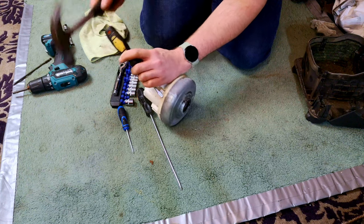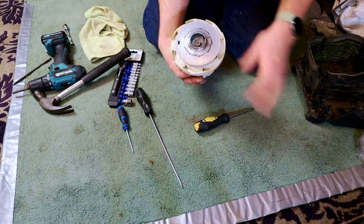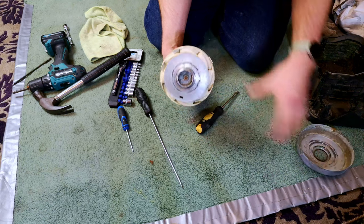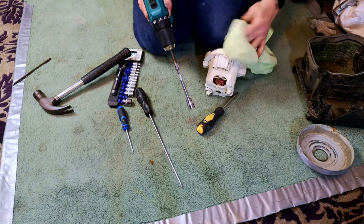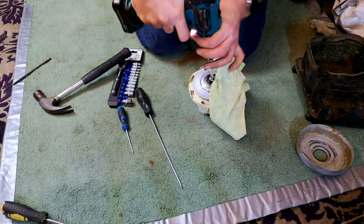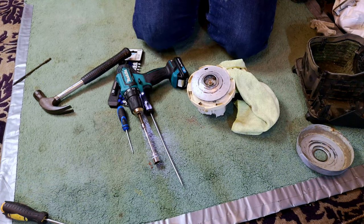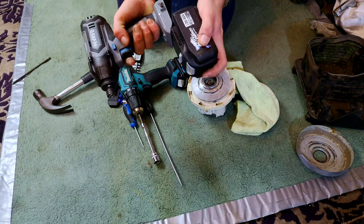It's this bit here that's seized on. That's probably the filthiest... it does turn - ah, there it was. Something had happened that was causing that to rub, because that sounds all right, actually. What do you reckon - should we take it apart the rest of the way, since we're here, and try and give it a bit of a service? The bearings could probably do with some oil or a re-grease, and that is fairly easy to do.